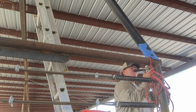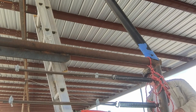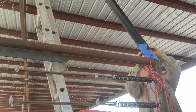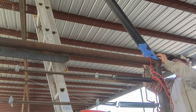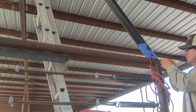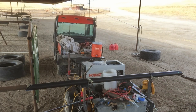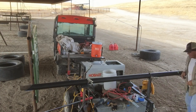Because ABS pipe is very lightweight, you can put it up where you need it and make your adjustments. Here you can see I'm using some blue painters tape to make markings, and I'm just using a grinder to start cutting away and nibbling until I get the fit that I want. Then from there we go over to the welding cart and start cutting sections of pipe.